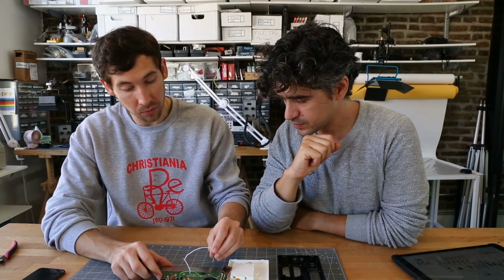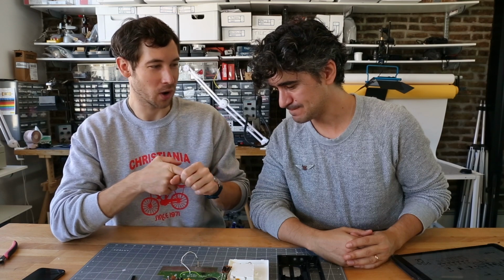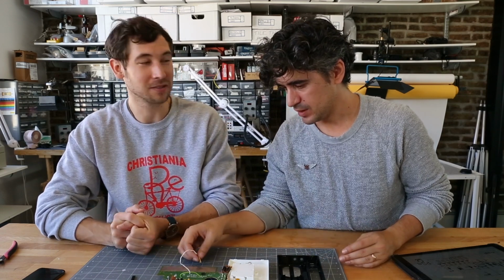We did some quick research on the Stylophone schematic online, and essentially what's happening is each of the 20 keys here has a fixed resistance, so that when you close the loop on a particular key, there's a different resistance associated with that. And through the analog circuitry magic, they are creating different tones by running it through a series of op amps and square wave or triangular wave generators.